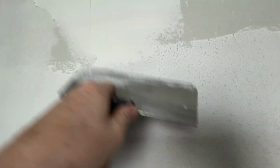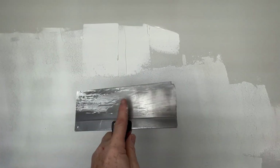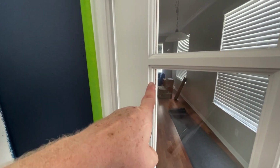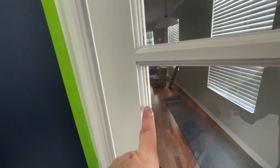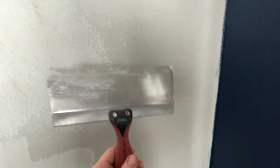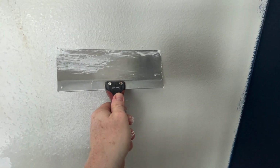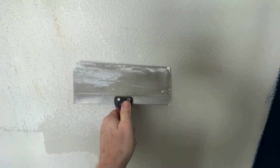Okay? You see, if your wall is not perfectly flat, then there's going to come a point at which you're pulling your compound on a part of the wall which has a different depth across the span of your blade. So over here might be nice and flat. Over here is a belly. It's going to be thicker here. Let me show you what I'm talking about. For argument's sake, this is our wall. We compound down here, right? So it's going to be thicker where this groove goes in, right? I know it's a terrible example, but the point is that that might happen on the span of your 10 to 12 inch blade that you're using. And consequently, picture that the issue is at the end of your blade, you'll have a line.